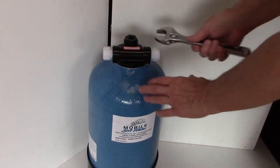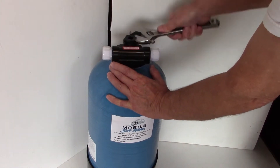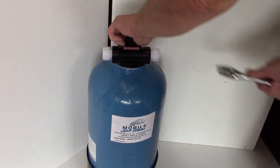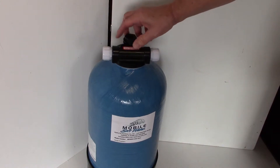To regenerate an econo-style water softener, you must first remove the salt port, as you can see here. After the salt port is removed, slowly tilt the tank toward you so that water flows out of the salt port. Remove approximately five cups of water.